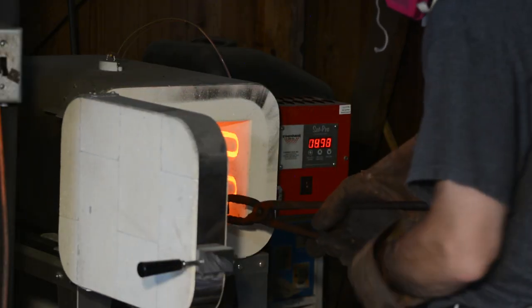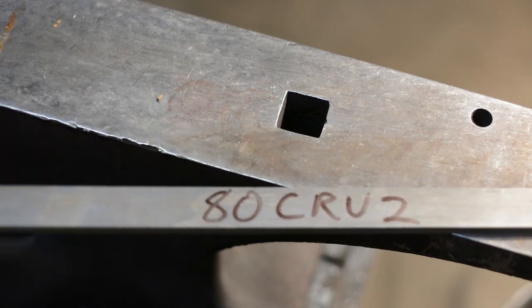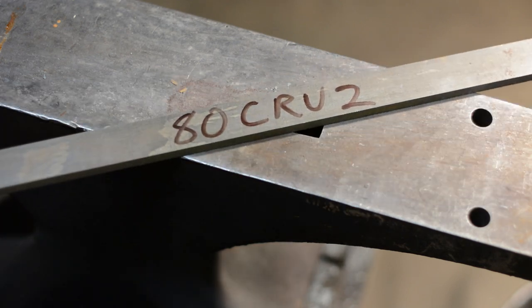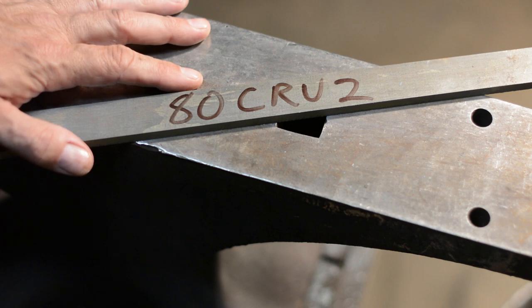So, before we start to do the testing, what can we test for? Given a certain heat treating regimen, that's the key, here are some things we can try to find out. Does it harden? Does it harden fully? And that's not always the same thing. Does it appear to have good edge holding qualities? What sort of grain does it have? How strong is it? How tough is it? How hard is it? Well, I'm not going to answer all those questions, and definitely not with scientific precision, but I can answer some of those questions well enough to get a general sense of what this steel can do.